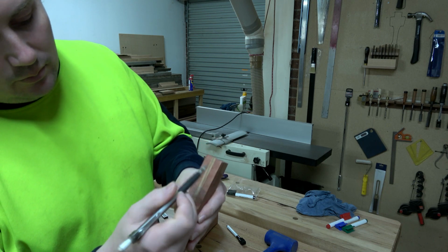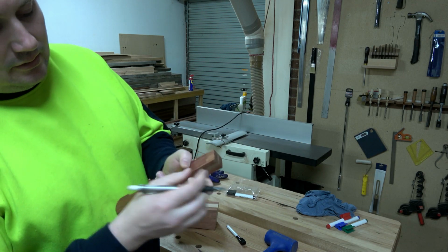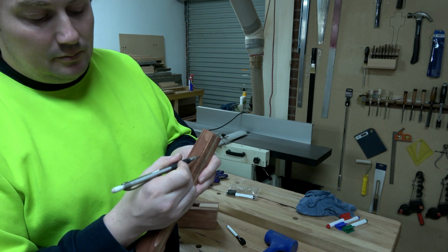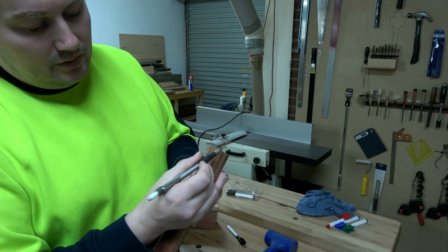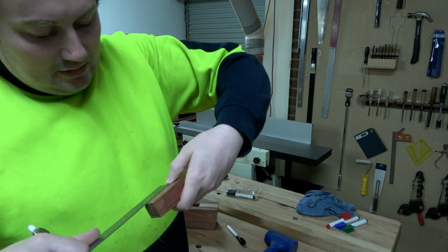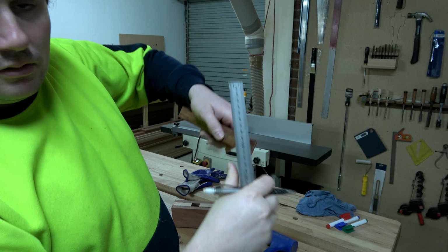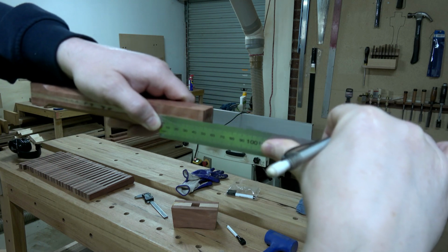And I also got that top mark there, which marked the top of the head. So these are going to splay out by the 3.3 millimeters at the top, and it will finish at 0.9 millimeters at the bottom, because obviously this is a slot that doesn't get any skinnier at the bottom. So it's going to be 3.3 at the top, 0.9 at the bottom, and the length of that is going to be whatever this length is, which I've got about 43 mil. Can you see that? What's going on here? Huh. I've got my hands all mixed up. Oh yeah. So it'll be about 43 millimeters.